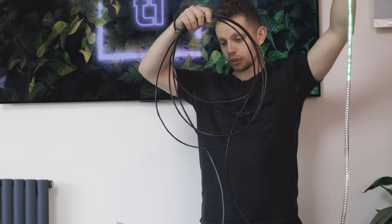In this box we have a standard 5-volt, 10-amp power supply which terminates in a barrel plug. What I'm going to do is snip the end off this and bare these wires. With this 5-volt 10-amp power supply, I've spliced it into the positive and negative terminals that go to the LED strips and to our ESP board. The data line has just been left as it was before. The beauty of this is it gives us more power for the LEDs and also powers our ESP board without it being connected to the computer.